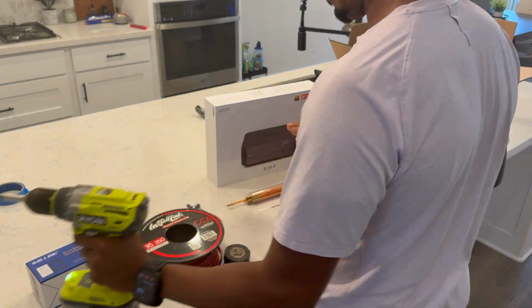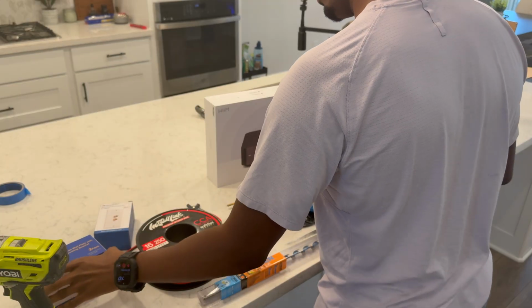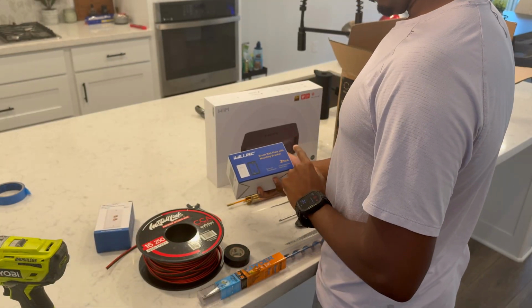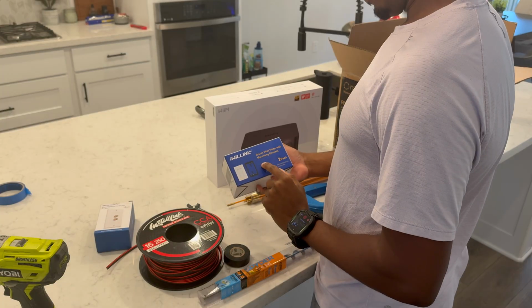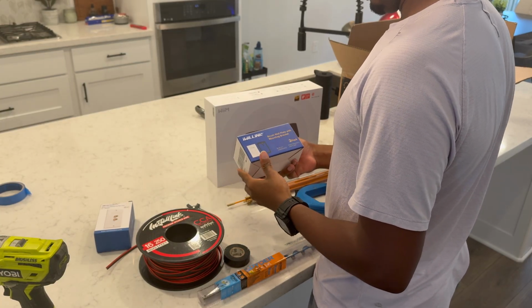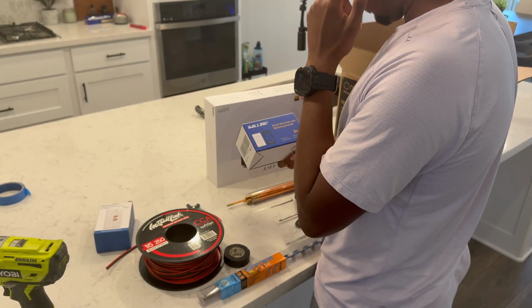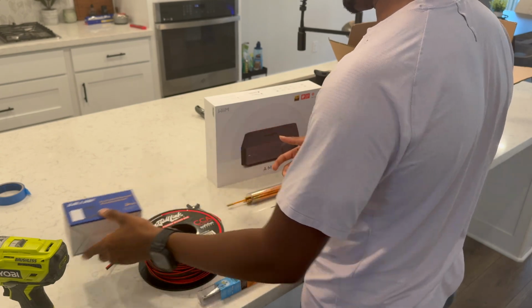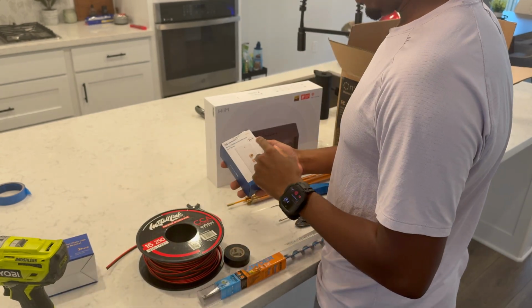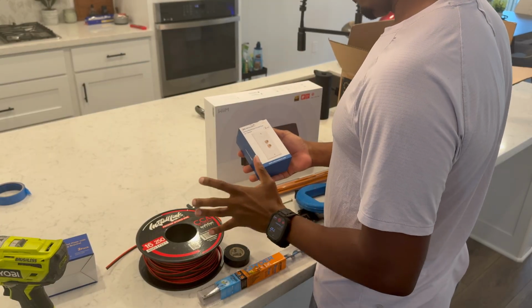Let's now talk about some things that you need. You need a drill, very helpful. Some of the stuff that I mentioned you don't need, I just recommend. For example, I recommend some type of wall plate. You could have a wire one where you could throw any type of wire through there, HDMI cord, not power cables. You shouldn't be running power cables through the drywall. That's not power rated, but speaker wires, etc. Or you can get a dedicated wall plate with the banana plug so that you can connect to speakers. Recommend this. Don't just have a random hole in your drywall.